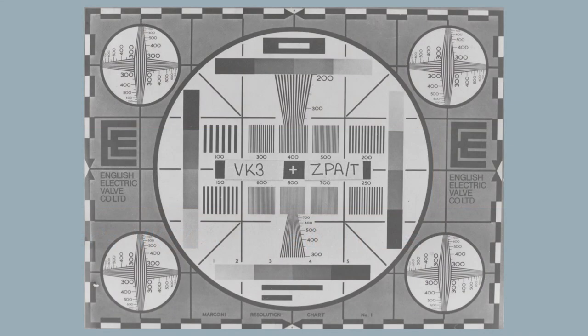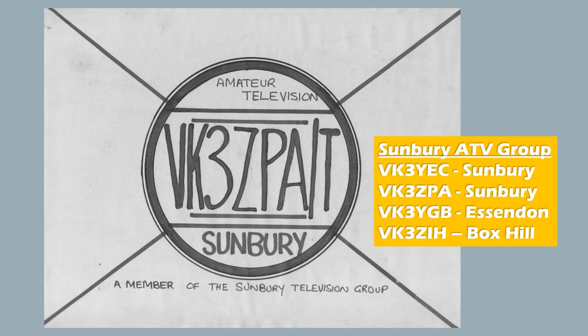Test patterns became necessary for people to give you decent reports. It was very difficult, in my case, to get much more than about 300 lines, but we did achieve it. This was a commercial card from English Electric. I was into photography at the time and made a number of cards for different amateur stations around by just photographing the call signs on a piece of cardboard in the centre of the screen. This was my commonly used card — the first one. You can see there are about four different sizes of printing there.